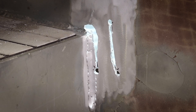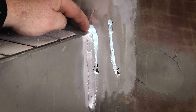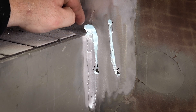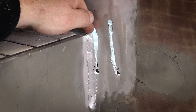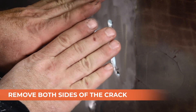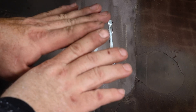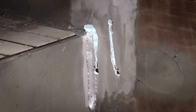You can now physically see where the cracks were. The hole we've got here is about a quarter of an inch, which is a little excessive, but given how hard this was to get to, using the saw made it a no-brainer — I'd rather cut it out quickly and take extra time to fill the void. The whole idea is to remove both sides of the crack, because a crack working back and forth traps contaminants. That dust and debris comes out during welding, gets stuck in the weld creating porosity and weakness. By removing both sides of the crack completely, you virtually eliminate the opportunity for contamination.